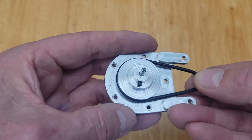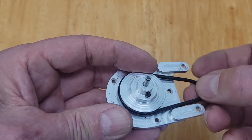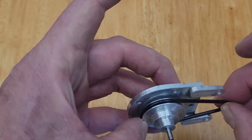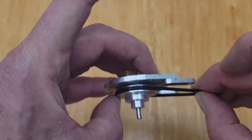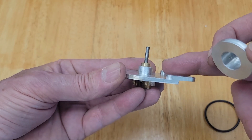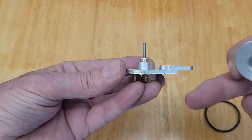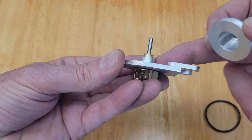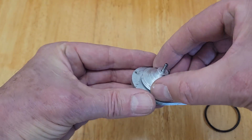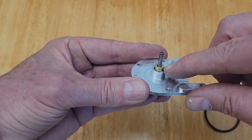So this is our Wallaby water pump. The thing I want to show here before we look at just the bracket is how the fan belt fits between these two mounting arms — kind of look at that geometry there. The purpose of this boss is to hold our brass bushing perpendicular to the mounting surface of the water pump. It doesn't need to be pretty because it's hidden by the pulley itself. We will use a reamer to create the correct hole there.